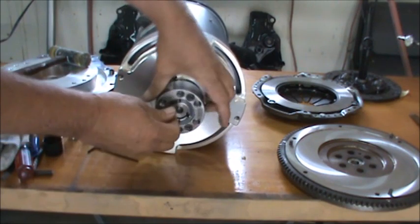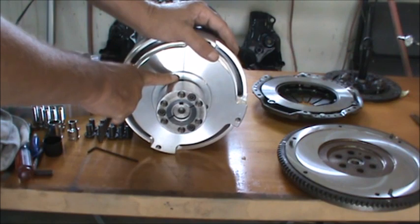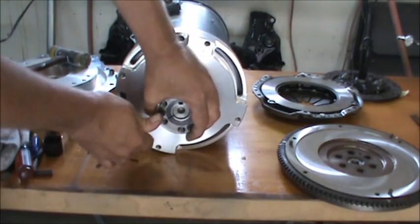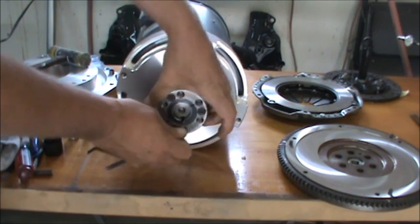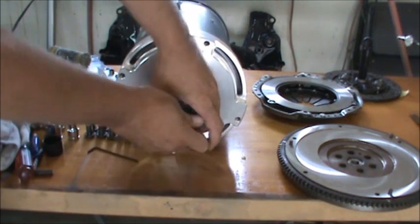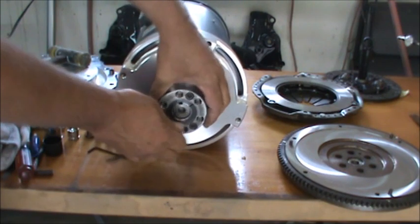I guarantee you, you'll play hell getting this off. And again, the set screw I set back here was just a little bit, and I barely put any on it. I don't want to mark the shaft up. The only reason I did is because as you tighten these down, it tends to want to pull the bushing off the shoulder, and I want the bushing against the shoulder as much as possible. If it comes off a little bit, that's okay. I just keep going around until I feel like I'm applying about the same amount of torque on each one and it's tight.